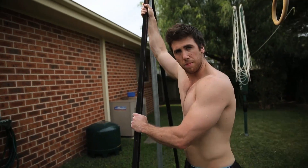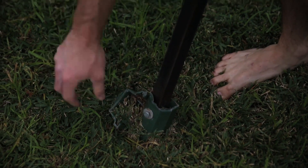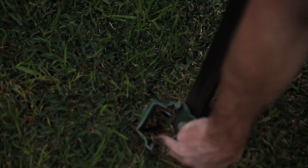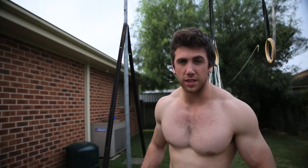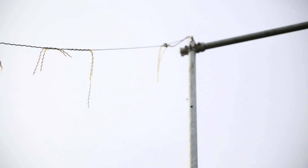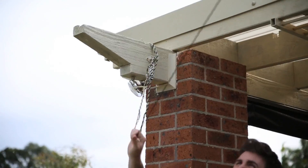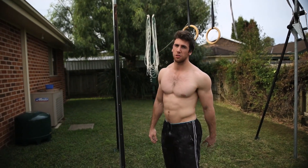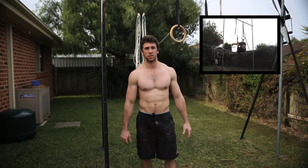We've got these black frames that attach about halfway up the pole. They go into a steel frame, and then there's an alternate green frame which locks them both together — very stable. Furthermore, on each side there's a very sturdy rope that follows all the way down and ties onto the pergola. The supports and the rope are essential. When we first made the structure with just the main frame, it was way too wobbly. It needs those stabilising features to make it practical.